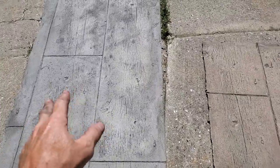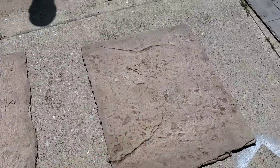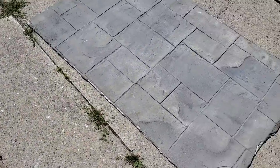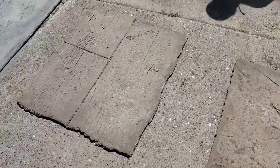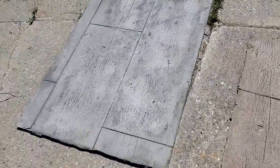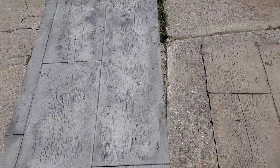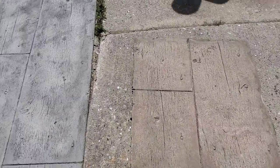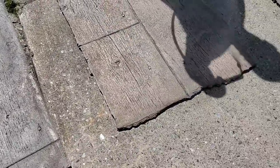So we got our samples washed and cleaned. We got the teak wash on these two. Now we're going to add the sealer — got them all cleaned and dried off. So we're just going to spray some clear sealer on for now. That should pop those colors a little bit. After you get the sealer on, you're pretty much done — two coats of that and you're done. That's the basics of doing a stampable concrete overlay. You can resurface just about any type of concrete with something like this.